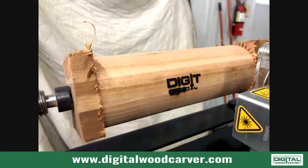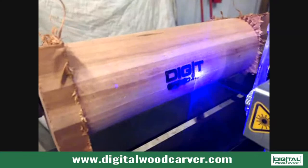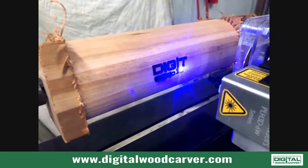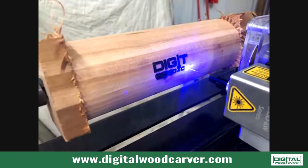When we are working right now, Burl's got the laser shield off, so we can all see the glories of the laser engraving on the fourth axis. But if Burl was in his shop on a regular basis, he would have the safety shield on there, because he's not always going to be walking around with his glasses on. That safety shield is basically a secondary protection barrier. So he can look at it and the shield is blocking that laser beam.